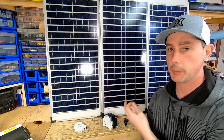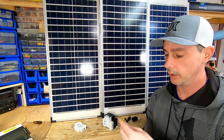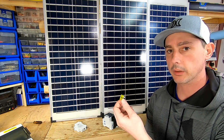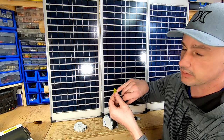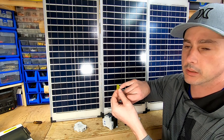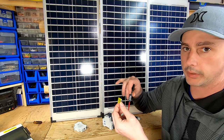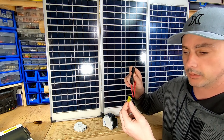If you're running your system in parallel at a higher amperage but lower voltage, you could get away with using blade fuses, but those are only good up to 32 volts. If you exceed 32 volts, the filament inside will arc and continue the connection, bypassing your protection. So only if you're in parallel can you use those.